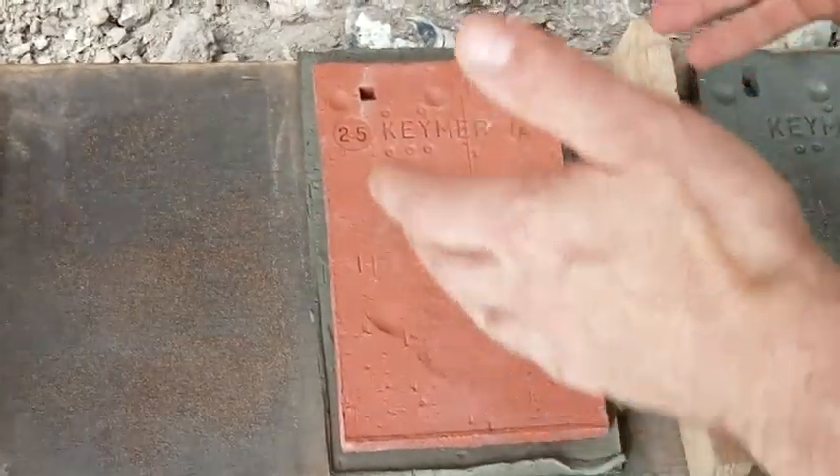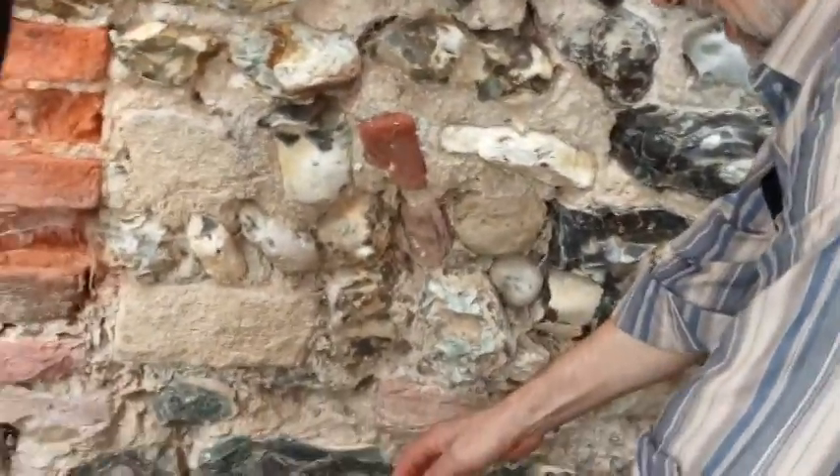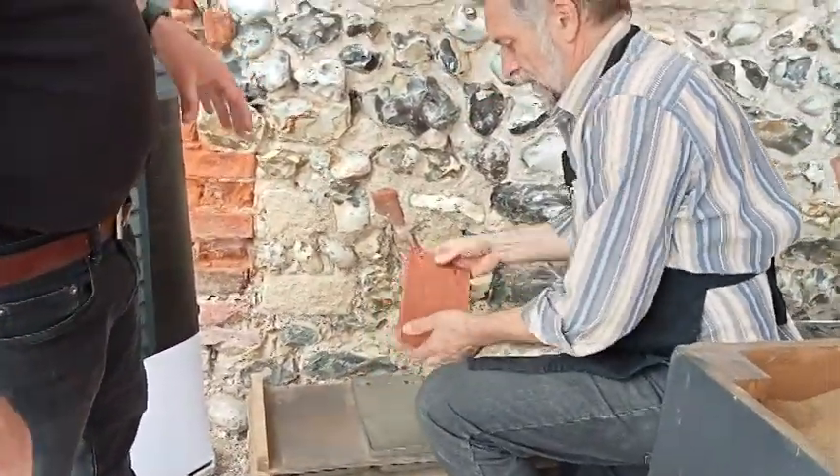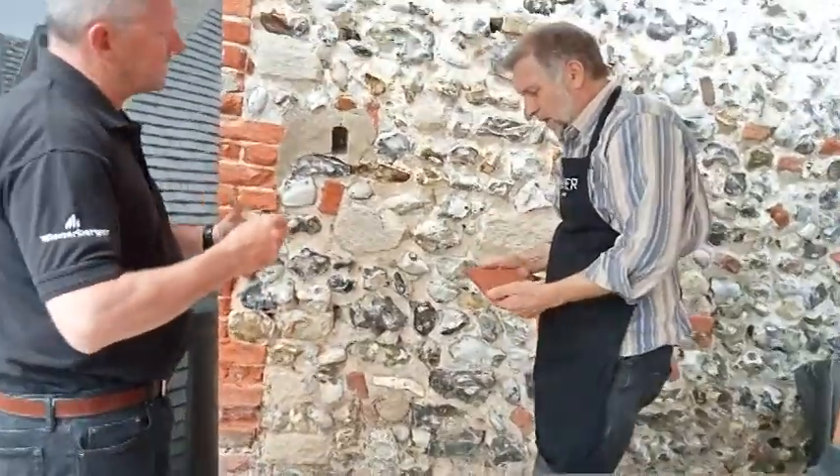What percentage shrinkage? It might be about 20%. Sometimes it's 12% up to 20% of shrinkage that you have to allow. So we have to over-engineer something — make it bigger and calculate to make it smaller.